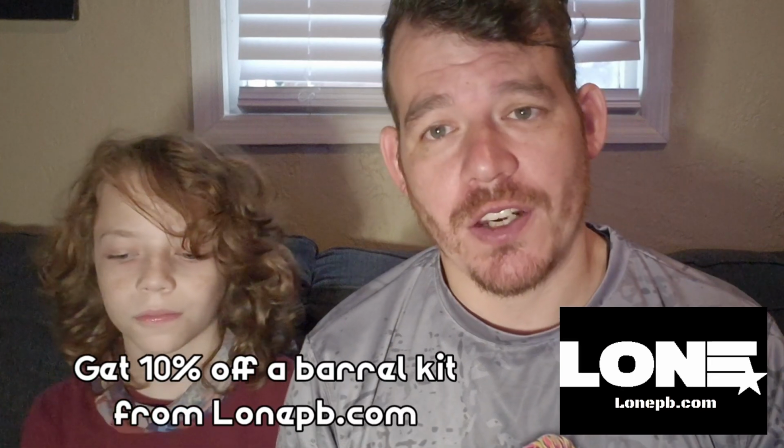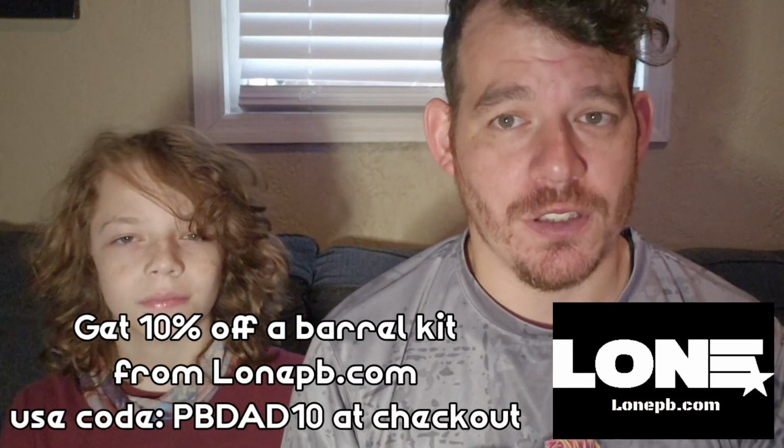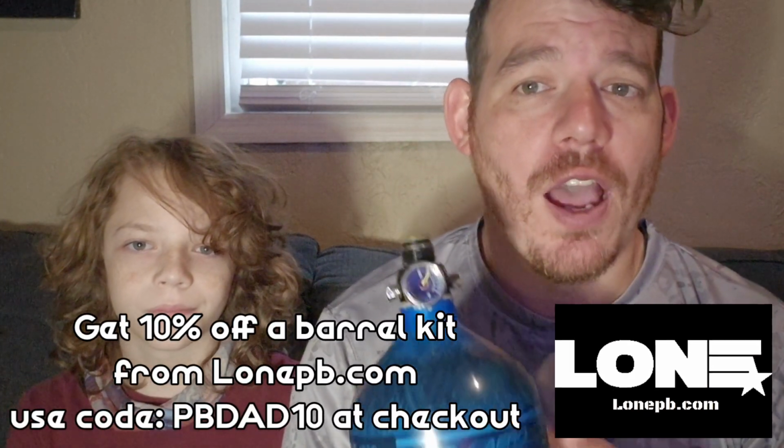Now, the reason I'm going over this topic is because recently I discovered that one of my paintball tanks has a leak somewhere in the regulator. I don't know where exactly it is because the leak is so tiny that you really can't hear it leaking. It's only after a few days that I noticed that the pressure in my tank goes down. So this tank was filled up last weekend and now it's back down to 0.